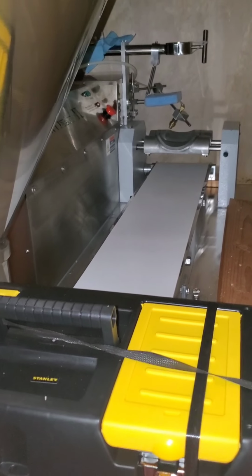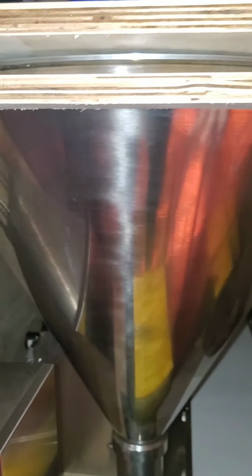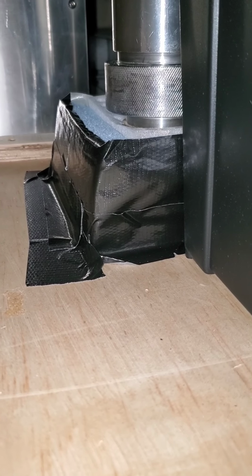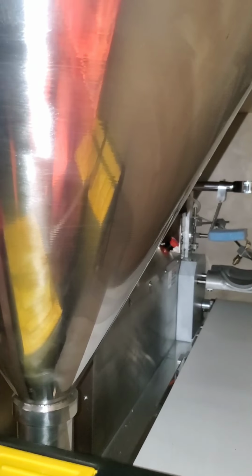Also, I don't know if I said earlier, on the hopper, when you take out this front support here that's holding it up to the ceiling of the crate, it's free to fall away. So when you remove this front piece, you have someone there ready to take the hopper out. The back piece does not come out, like I said earlier. And down there underneath the orifice, it's hard to see now, there's a big foam, just a pillow. You can take that out first once you get the top brace removed or loose, then you can pull that out so the whole hopper will come out easier. And remember, the hopper is very heavy, so have someone that's capable of holding it up. The auger is inside the hopper with some padding around it like it would be on the machine.